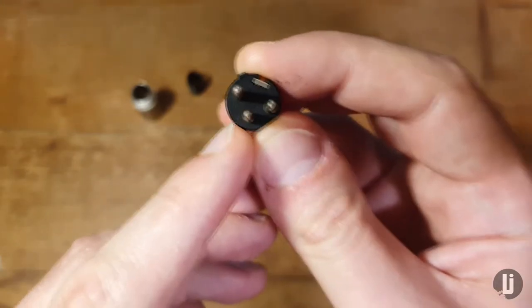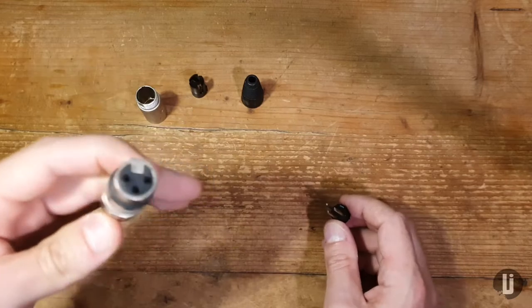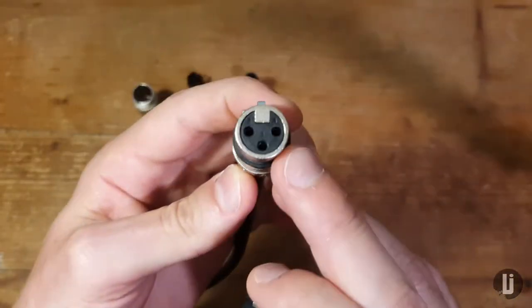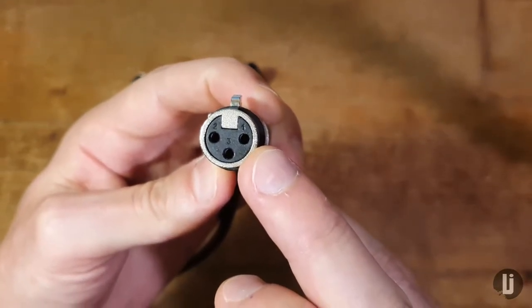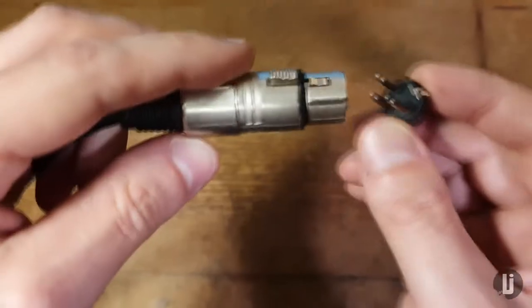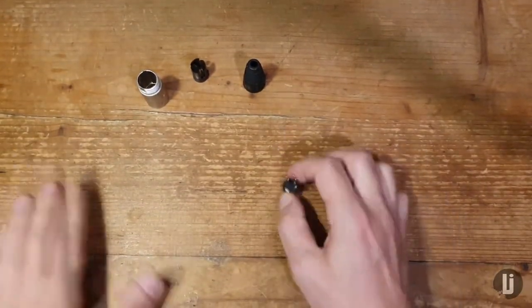There you go. That with number three, that's the cold one. Now, female connectors, same story. And if you were so kind as to focus, there you go. As I said, it's mirrored. This time the one is on the right, still ground. On the left you got the two, which is hot, and on the bottom you got number three, which is a cold one, because they go face to face, because they're male and female, you know? You know what I mean.